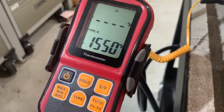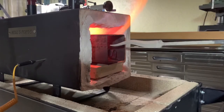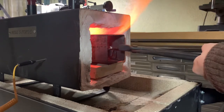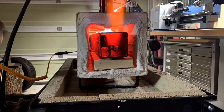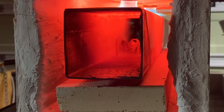We are at our target temperature of 1550 degrees, so we'll add our dagger and let it soak at that temperature for 10 minutes. Then we'll remove it and let it cool off to room temperature. We'll do that complete cycle three times. You can tell how even the temperature is inside the pipe by how even the color is all the way down the length of the blade.